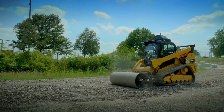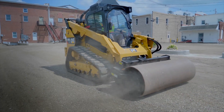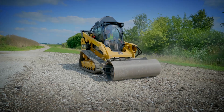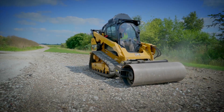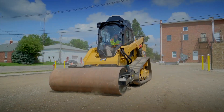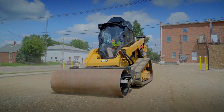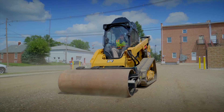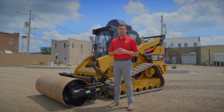This gives you a wide frame in order to provide almost 12,000 pounds of down pressure into the soil to get that compaction. The advantage of using a lower ground pressure machine such as this track loader is that you can run over sprinkler heads with this drum compactor — you have the ability to work around them without damaging things on the underground surface, such as in a baseball diamond or a parking lot that's getting ready to be paved.